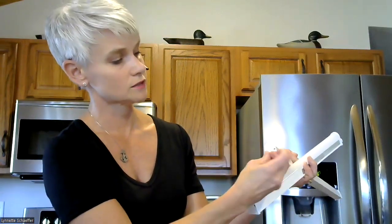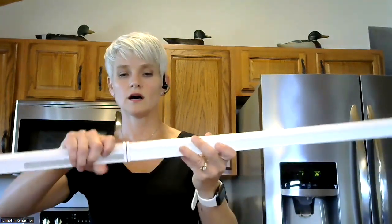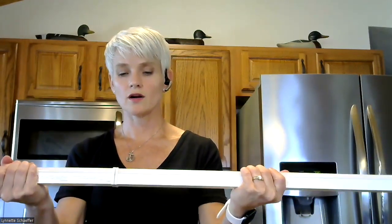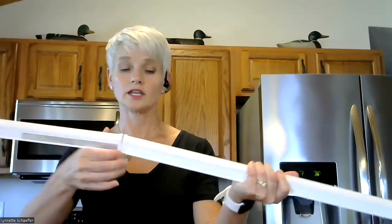As mentioned, it also comes with this little end connector. When you get it, you can plug one fixture in, and on the next fixture you take off this little cap that covers the connection port — you pull that off and this allows you to continuously butt them up next to each other one by one. Once you have them butted end to end, you can just keep running your rows however many you want.